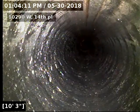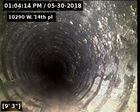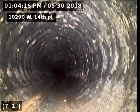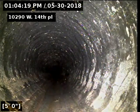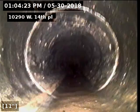10290 West 14th Place — the sewer line has been cleaned, tested, and inspected and is flowing well at this time. The sewer line does have a few very slight offsets and also a very slight flat section in the PVC piping that is in the street. Recommendation is to clean the line annually to maintain the tree root growth.